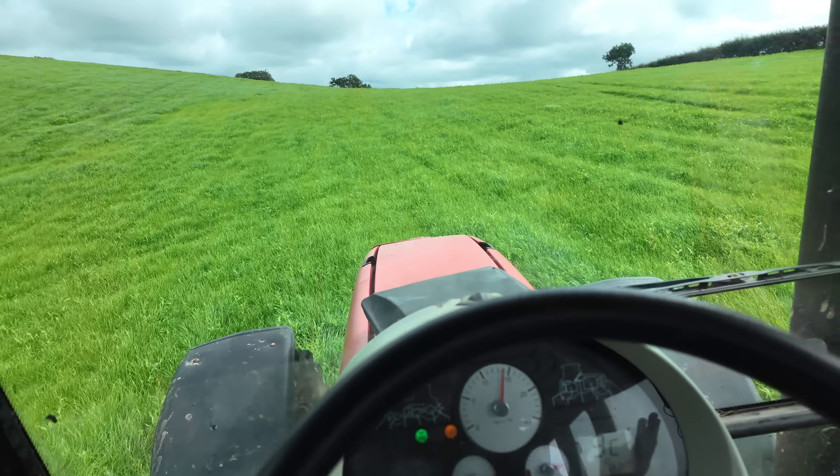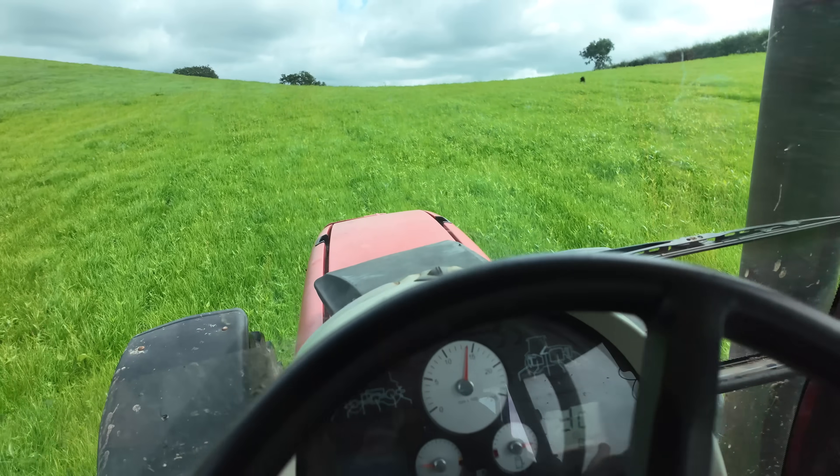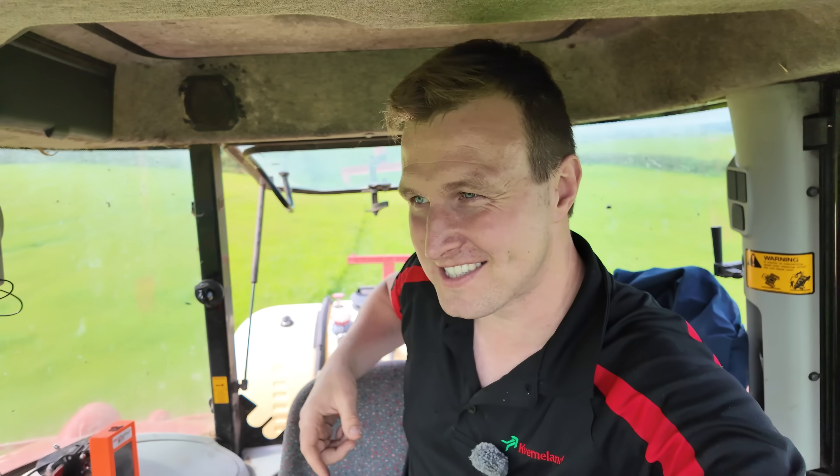How is this working? How have I built auto steer? I'm going to be honest with you — this was way easier than I expected. I have done way more complicated code than the code to make auto steer work. I do understand it's early days; I still have to automate the headlands, automate the headland turns, and make it accurate enough that you could mow with it — and I'm pretty sure that's where the complication is going to come from. But just to get an auto steer system working has actually been fairly straightforward. We are 36 centimeters offline — that's close enough that I could barely drive at that accuracy, so it's still more than acceptable, especially considering this is the second iteration of the code.